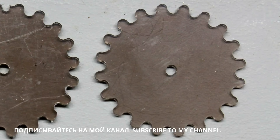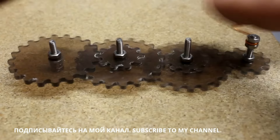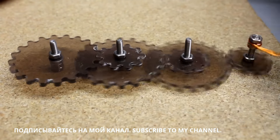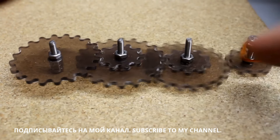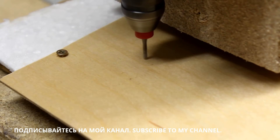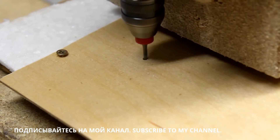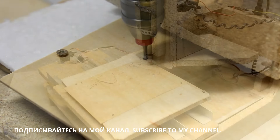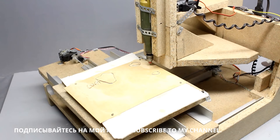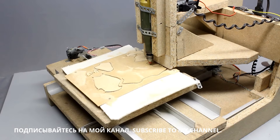Use a file to finish the gear wheel. The quality of the parts is sufficient to build a gear train. The router can cut 1mm plywood more easily, so you can increase the speed of the machine slightly. The parts of the puzzle are mirror inverted because the edges at the bottom of the plywood are cut smoother than those at the top of the plate. Approximately one hour is needed to cut all parts of the puzzle — this is not a speed-record-breaking CNC machine.